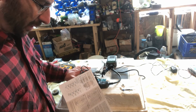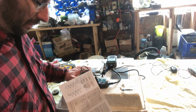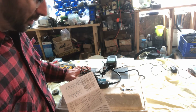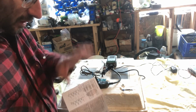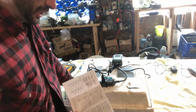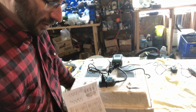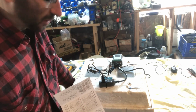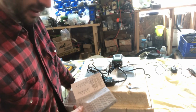There's a heating differential value. So that means you're plus or minus. There's no cooling on this. There's a cooling differential value. We can ignore that, because we're not cooling anything. We're just heating. The heating differential, I want it as close as possible. So if it's 37.5, I'm going to set this at 37.3 as my differential, meaning the minute the incubator cools down to 37.3, the heater comes back on again.